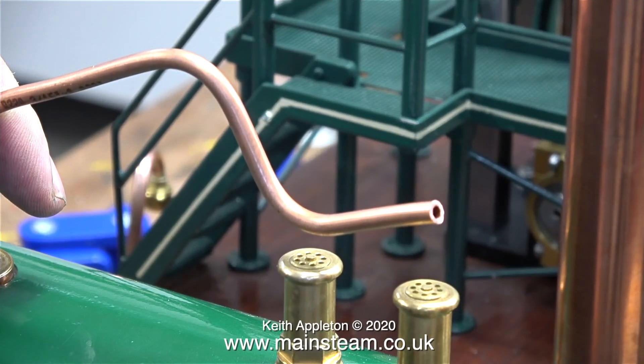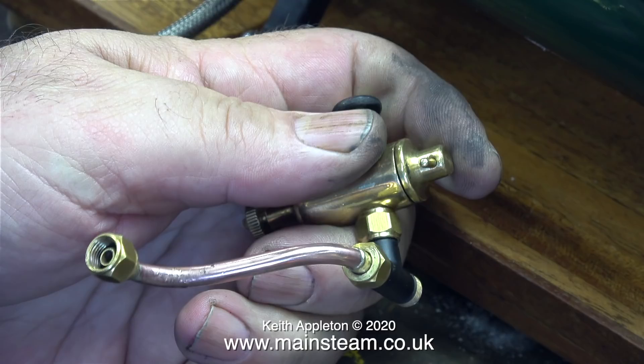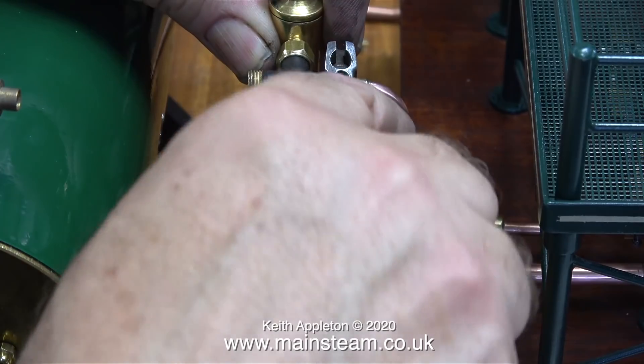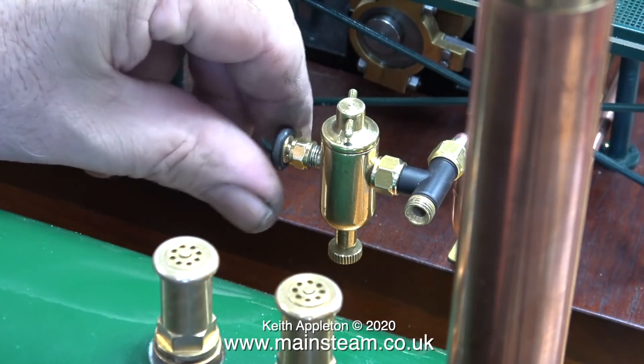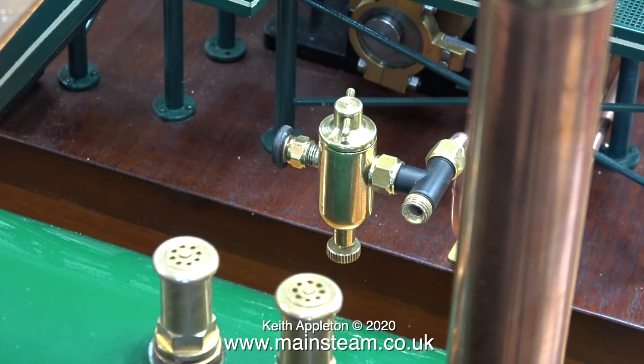Now I need to make a piece of copper piping to fit the lubricator to the union on the engine's inlet — it's like an S-bend piece of copper piping. Here it is after I silver soldered the unions in place. I first tried it one way round, which was quite a good position, but unfortunately there will be a steam pipe in close proximity to the lubricator if mounted like this. A simple solution: I just turned it round. This will make it much easier to drain the lubricator and adjust the oil control valve without any risk of burning fingers.